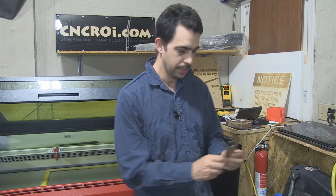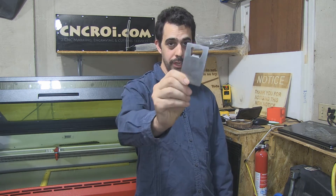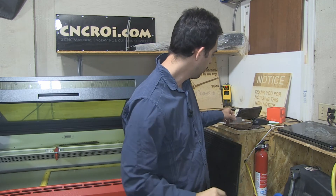Now, that's important. If you have a manufacturing company and, for instance, you would need a thousand of these plates fiber marked, there's two ways of doing it. One is with the CO2 tube, and that means we have to add Cermark, which is a ceramic bonding process, onto the metal. Then we use the CO2 to bond it to the metal. The problem with that is it chips, fades, and comes off over time.